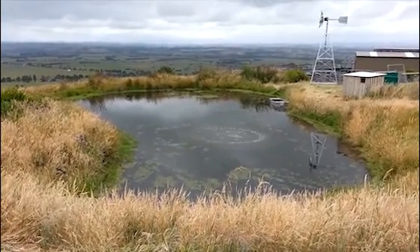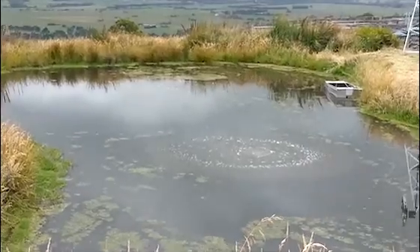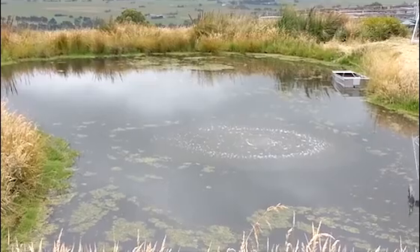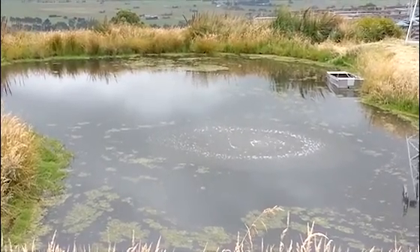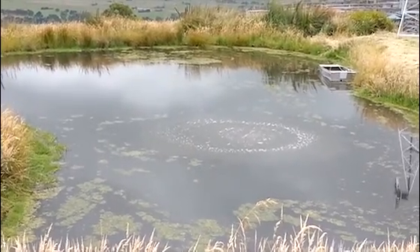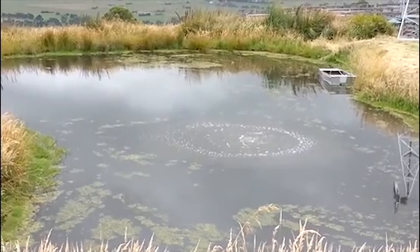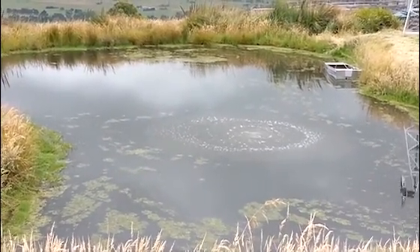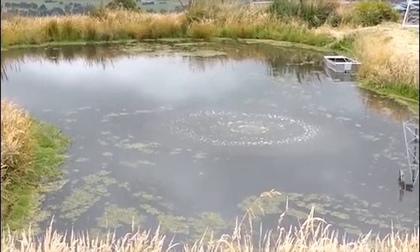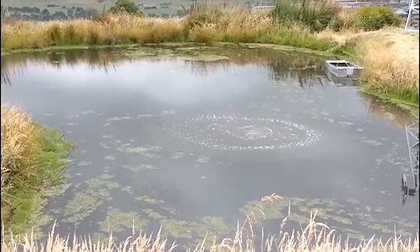At the end of that air hose is a couple of diffuser discs — in this case we've used two single discs. As the air rises, as the bubble rises up through the water, it brings up the lower levels of water which are void of oxygen. So it destratifies the dam, giving it a uniform temperature throughout. And as that water hits the surface, it fans out and has a good gas exchange between the air in the atmosphere and the water that's come up with low or no oxygen, circulating the entire body of water, aerating it and improving water quality.